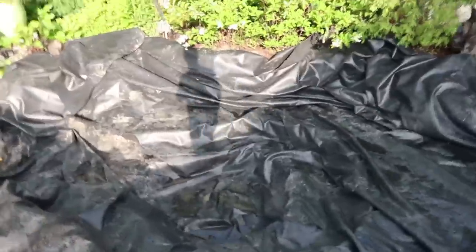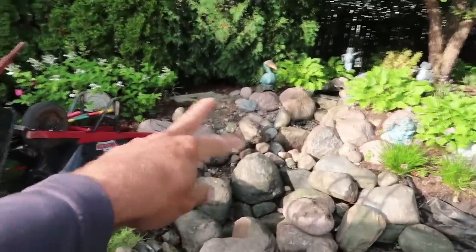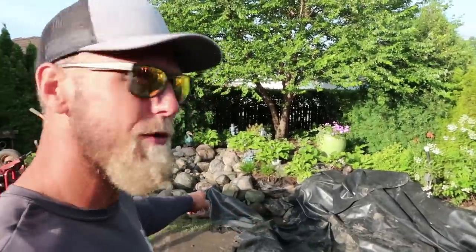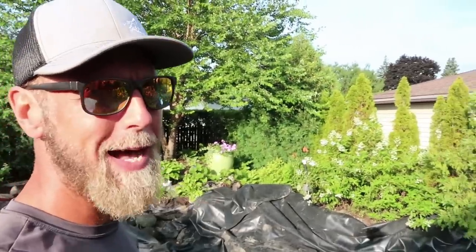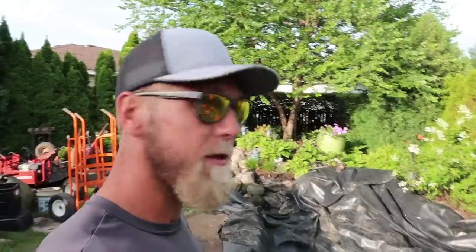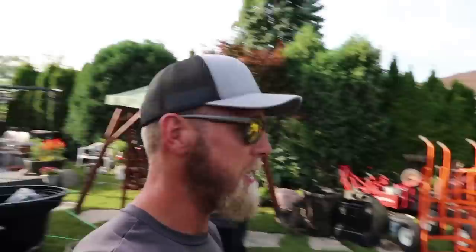A couple of things we need to do today: one, get our skimmer installed — it's going to sit over on the back corner — and then get our 6,000 biofalls installed right over here, and then rebuild the waterfall as well. We're going to start by focusing on rocking in the pond, getting the skimmer set up, and getting the plumbing done, worrying about the waterfall as one of the last things. I really want to focus on the shape of this pond. We're going to have a custom bridge built and shipped in — it'll lead from the grass area over to a bench area where that green ceramic pot is sitting on the outcropping stone. We need to account for the width and length of that bridge when designing the pond. It's going to be a really organic process, making this pond as big as possible because the homeowner wants to add tons more fish out here to enjoy this incredible transformation.